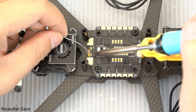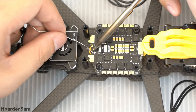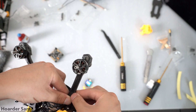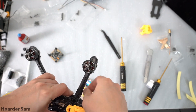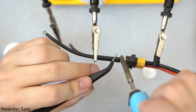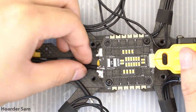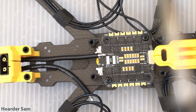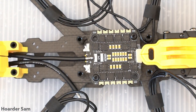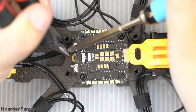It's time to bust out the soldering iron and solder the capacitor to the ESC. I like that this Taker stack has dedicated holes for the capacitor — I can solder the capacitor and battery lead separately and not worry about having to do them at the same time. The motor wires hanging around were getting in the way, so I used some cloth electrical tape to secure them to the arms. The Mario 5 frame comes with a hard-mounted XT60 connector, so it's time to wire it up. Cut the wires a little long, then solder them to the connector. Mount this in the frame and route them through the channel under the VTX. Now that we know where the wires are going to end up, we can trim them to the exact length and solder them to the ESC. Because of how large this battery connection is, this is going to be the most difficult solder joint to make, so I recommend using a large soldering tip to get heat into the joint as fast as possible.